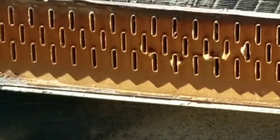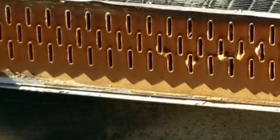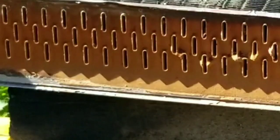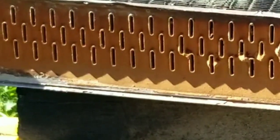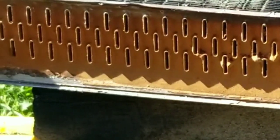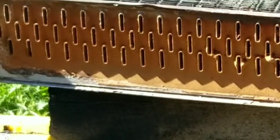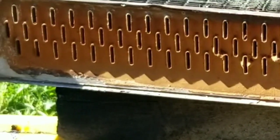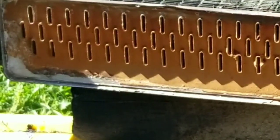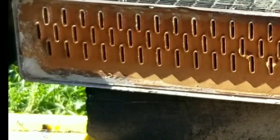You really don't want to be blocking the tube on a damaged tube, because you always run the risk of it failing again. It can have corrosion inside. It's going to have the coolant just sit there without coolant flowing through it. So you want to take the coolant right out. You don't necessarily want to remove it because you don't want to upset the fins. But on each end is where you want to do the repair, not just block it in the middle. So yeah, let's go ahead and get this cleaned up.